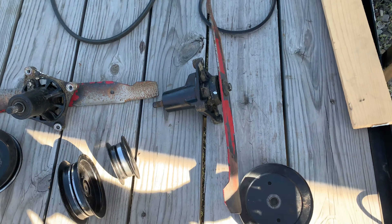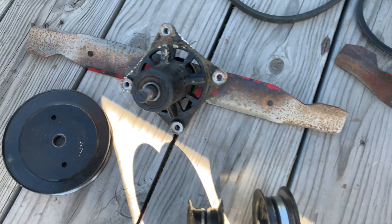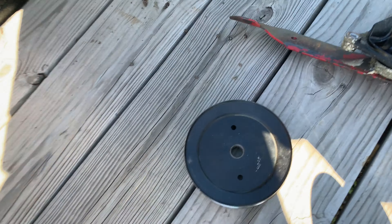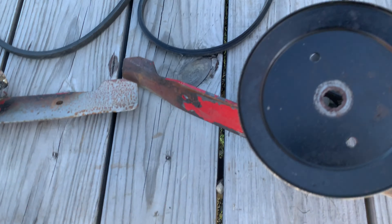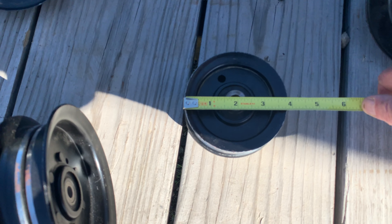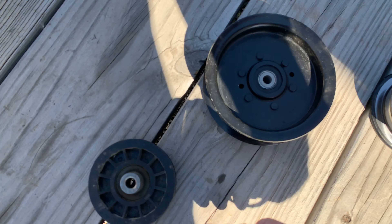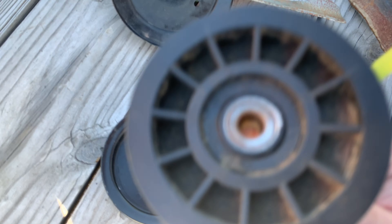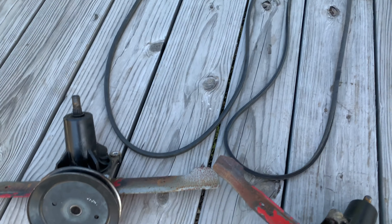Here's all the stuff that I replaced. These are four-bolt mandrels. Here are the old ones and old blades. A lot of times it's best to measure this stuff. On this V-idler it's a little over six inches — same with this one here, both the same size: one for here and one for there. These are called flat idlers. This one is four inches lip to lip. This one is five and three-eighths inches. And this one I ordered by mistake, but it is for the drive belt underneath — the ground drive belt for the transaxle — I replaced it along with those two belts.